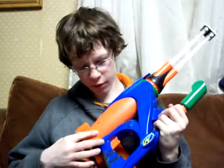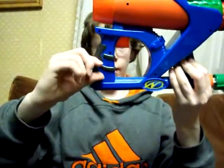The pump to the tubing was fixed because I couldn't use a tubing that was any smaller because that wouldn't be enough air to get through, and they actually don't make it that small. So I actually used one right over that size. So 1/4 inch inner diameter and 3/8 outer diameter, and it just happened to fit right there and connect those two plastic pieces. I used a bunch of goop, JB weld, and then finally 2-part epoxy, and that's got it held in there, and it's airtight.